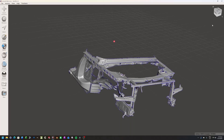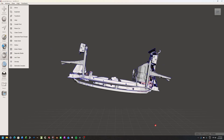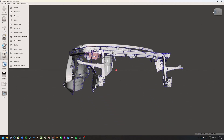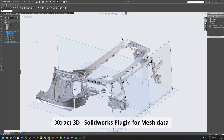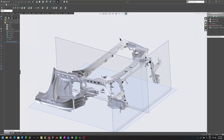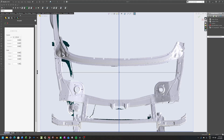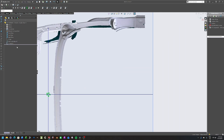They've stopped support for MeshMixer, which is a shame, but it's a really cool tool for post-processing and basic editing. Generally I roughly align each scan in MeshMixer to get it into some sort of coordinate system within a couple of degrees each way, and save each one. Then for one central piece I'll bring it into SolidWorks. In that software I use a plugin called Extract 3D — it lets you create planes and finely tune the mesh alignment in 3D space, ensuring the mesh is properly centred. That's going to be really important later when modelling, because everything will be split down the centre line of the car and mirrored.